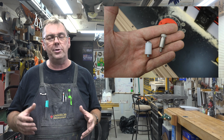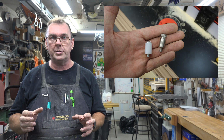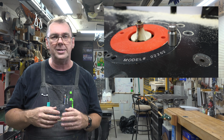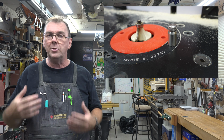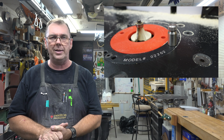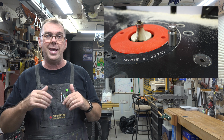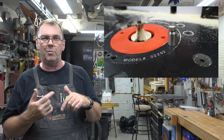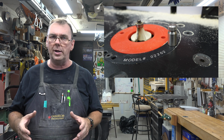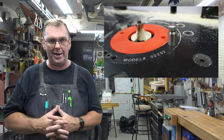Especially if you're kind of on the end grain. That end grain can really be a problem because it really wants to grab. It's a much tougher cut for the router bit. It's a much tougher slice because, of course, it's cutting the end grain. Don't believe me? Try any tool cutting end grain. Try it with a block plane and see how well it does. Because essentially all you're really doing with a router bit is you're using a plane over and over and over again as that bit rotates to cut the end grain. It's a tough cut. It's hard on the machinery and it really wants to grab. But the support of the starter pin will hopefully prevent that grab.